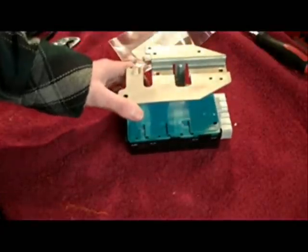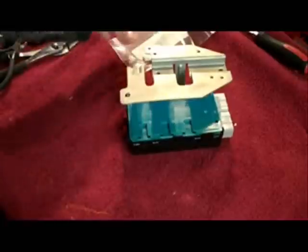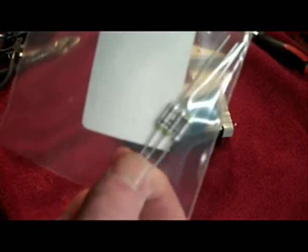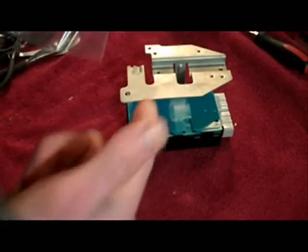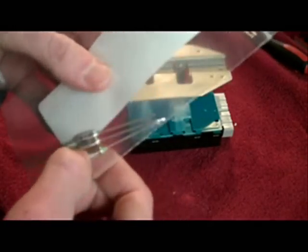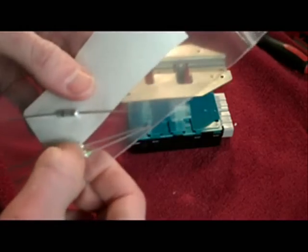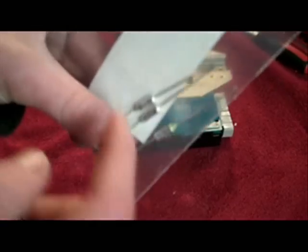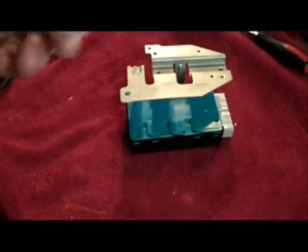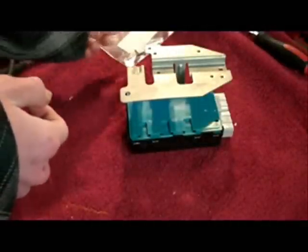What they did is they just replaced the thermal fuse. They got theirs from Goodman; I got mine here. These are 167-degree thermal fuses — I got three of them just in case I mess up. The one inside is 168°, but since it's only one degree lower, it shouldn't affect it, since it'll be blowing just one degree sooner if it does blow. I got these from Newark.com, based in Illinois. They got here in a couple business days, which I'm pretty happy with since it was basic UPS ground.